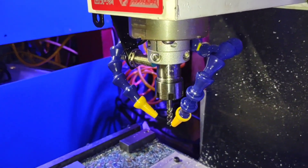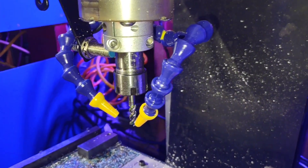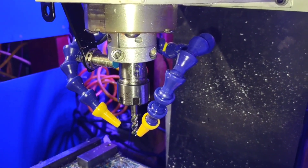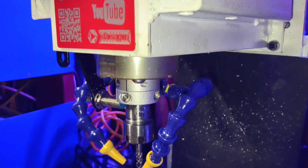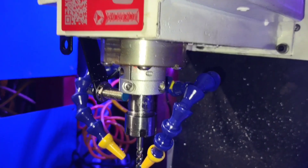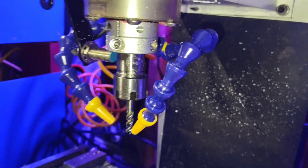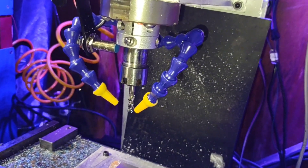The spindle uses two tapered roller bearings, and I actually made two additional bearings that go in the middle. The caps are cast iron that I machined out on the mill and lathe, and it uses an ER20 straight shank.